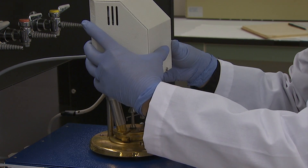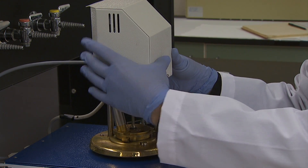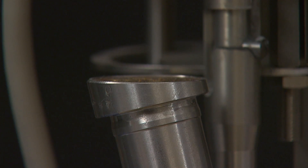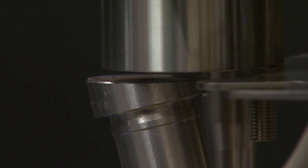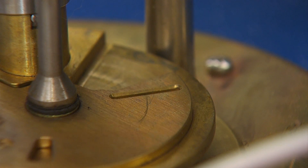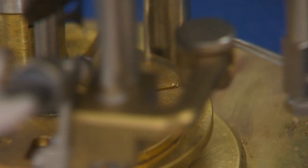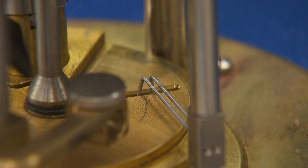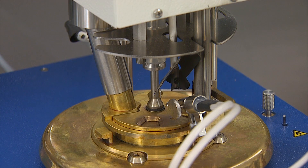Very gently swivel the controller head clockwise until it can be carefully lowered onto the test chamber top. Notice that there are electronic pins that fit into the temperature probe or flash detector piece. Be certain that the open and close arm is properly inserted into the notch on the lid that will cause proper opening and closing of the top of the test cup. All of the parts are extremely delicate and great caution must be observed throughout all assembly steps.